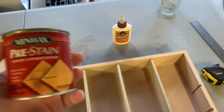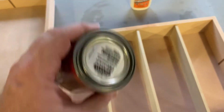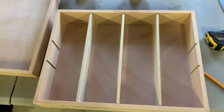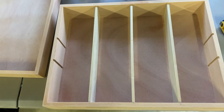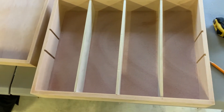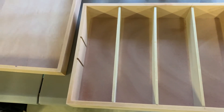What I'm going to do this time that I didn't do last time is use some of this Minwax pre-stain wood conditioner. It's not a necessary step — obviously, because I didn't do it last time — but I did use that stuff when I made my game table. I'm going to see if there's any difference between the two boxes in using it. You're supposed to stain about 10 or 15 minutes after you put this conditioner on, so the next time you see the box it'll probably have some stain on it.